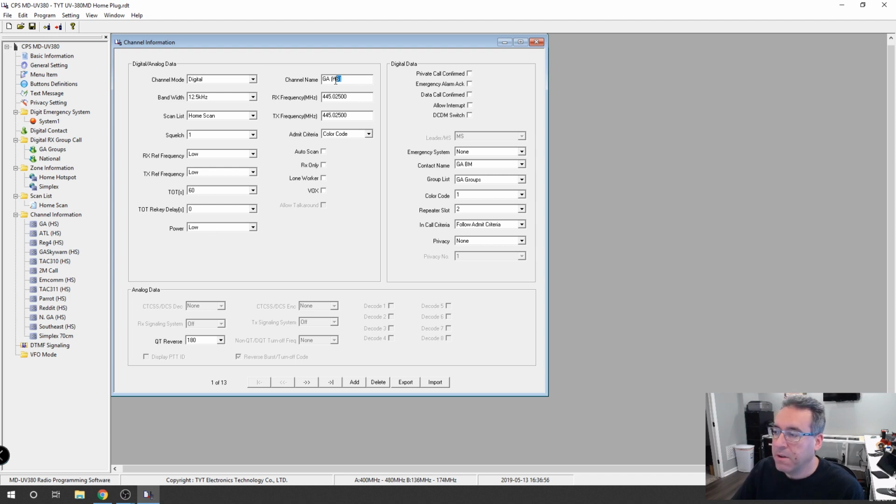Channel name, I've found through practice that you want to put some kind of nomenclature in your channels that defines what group they're in. So for example, I have the Georgia Brandmaster in here off of my hotspot, HS. Now, that is also bound not only to a talk group, which we'll see in a second, but a frequency pair. There are repeaters in my area that also support the Georgia Brandmaster. So they're on different frequencies. How would that work? Well, they'd go in different zones, but when I'm creating the zones, I need a way to differentiate them in the channel list. So in this case, I put parenthesis HS close paren to define that this is on my hotspot frequencies, which is here, 445.025. So just encouraged to do that. It makes programming your radio a little bit easier.